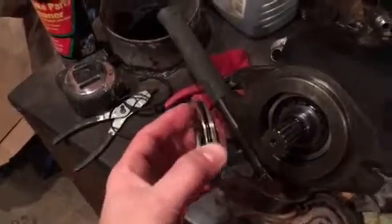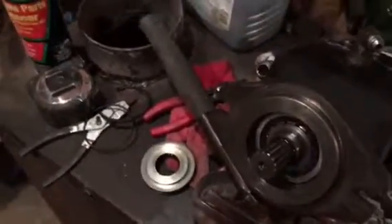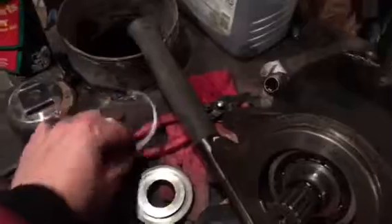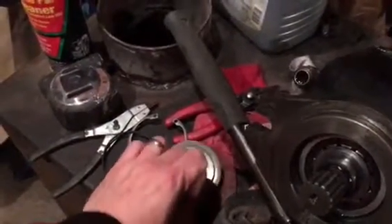This thing should be back in working order. We just need to heat up the garage and get it back in there. If your hydraulic drive motor on your tractor is leaking, that's probably what you're going to find — very simple: take out the lock ring, replace a couple rings, and replace the axle seal.